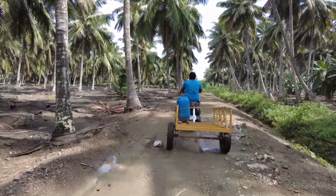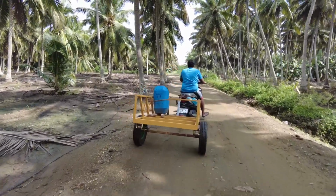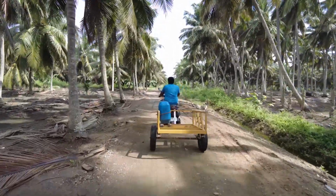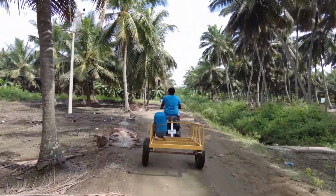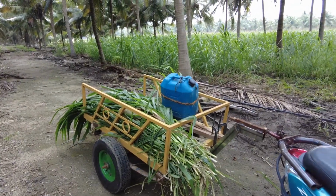After this trial run, I found out that when you move the towing arm as close to the ground as possible, the effect of the imbalance forces that come from the trailer are the minimum. So this is why you do testing. Here you can see the position of the towing on top of the bike.